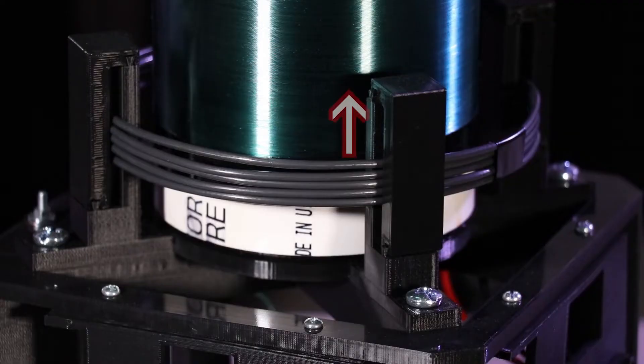However, reducing the turns also comes at the expense of reducing the magnetic coupling between the primary and the secondary. But I designed this mount to allow me to adjust the height of the primary so I can adjust the coupling — raising it means higher coupling, lowering it means less. Getting the coupling right is a really crucial part of designing good Tesla coils. If you're interested in learning more, go check out my featured segment in Lab Coat's video about his coil based on this driver.